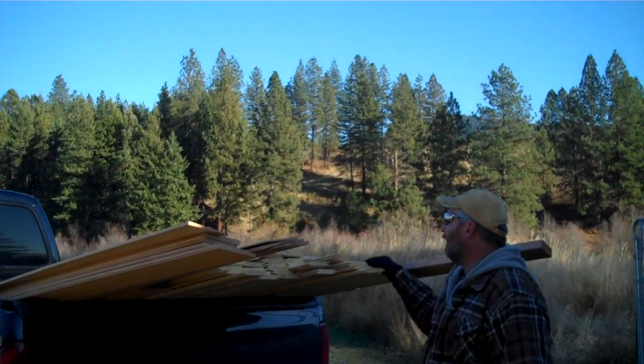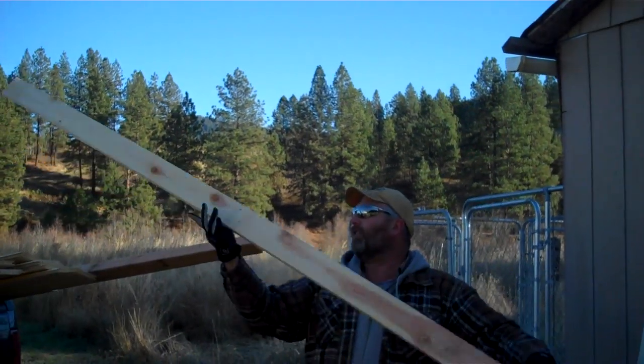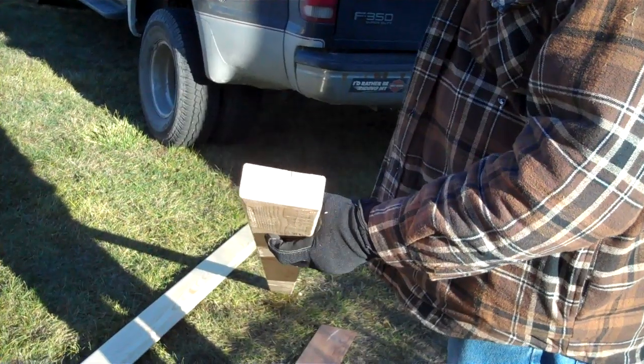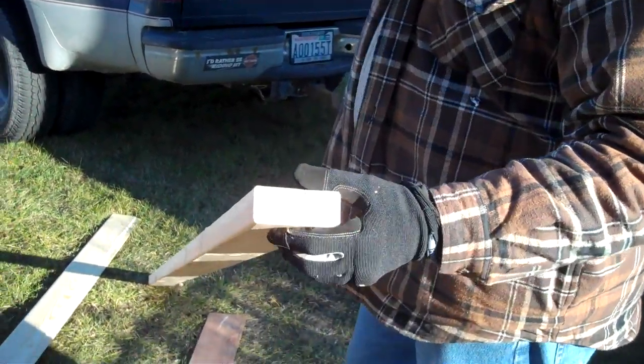And then I've got a bunch of 2x4 building studs for the building of these walls. Whole bunch of 8-footers here. Again, when you're buying wood, you want to pick through the bundle a little bit. Make sure nobody really sees you doing it at the lumber yards. They frown upon that, but you don't want a beat up board.